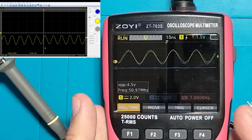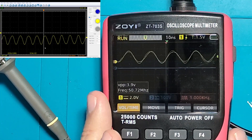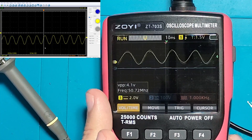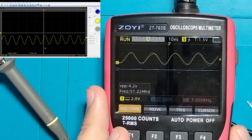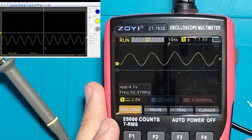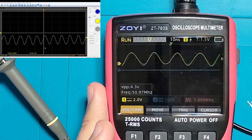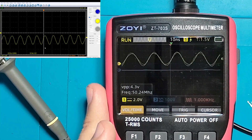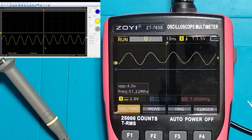What all other YouTubers say about this oscilloscope — that it cannot reach 50 megahertz — it can, and it will do it easily. Others complain that auto setup does not work properly at high frequencies; I've even seen that from a trusted YouTuber, I will not name anyone. But you see here — auto on 50 megahertz will not get stuck, it will work, it will set up, and peak-to-peak is 4.3 volts. That is what I wanted to show you regarding oscilloscope mode.